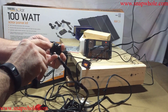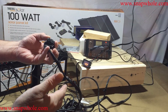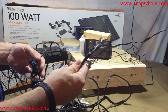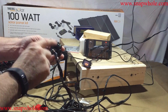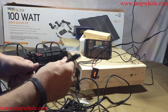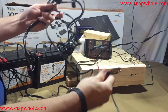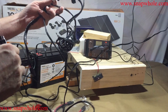In a Jeep Liberty, when you transmit the whole dash panel lights up — they don't have enough RF filtering in that Liberty. In my Toyotas I've never had that problem, but I still run a toroid core as a precaution to keep RF from going from the antenna to the power in the car. The end of this cable is 10 gauge and the middle is 12, so there is a mismatch, but I know 12 is the limit for this cable. I wrapped it with black tape and it's probably seven or eight years old, so I've used it quite a bit. I'm going to use this to extend the reach of the panels so I can get them in the sun better.